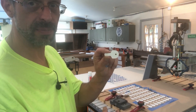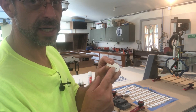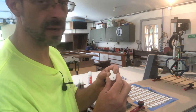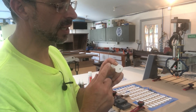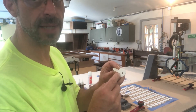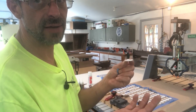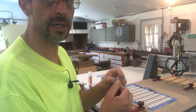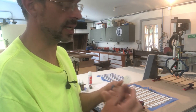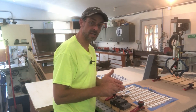Look at the size of that part — this has like 1.3 inches of area. At best, if I was trying this with a vacuum table, I'd have to make a special fixture to work around the hole and the shape cut, and I would have greatly reduced area. I might only have five pounds of holding pressure — that is not enough to keep this part secure while you're cutting it. So that's where super glue shines and vacuum fails.